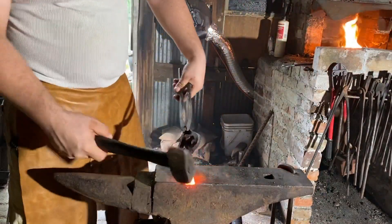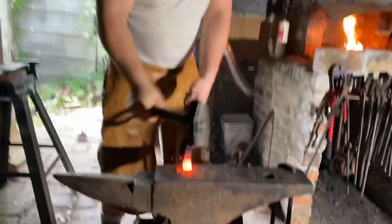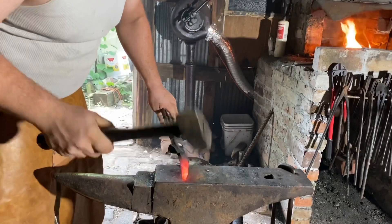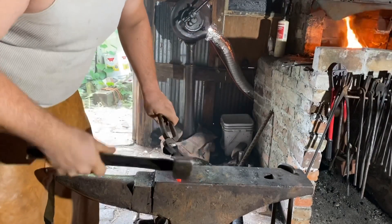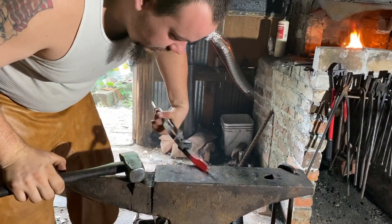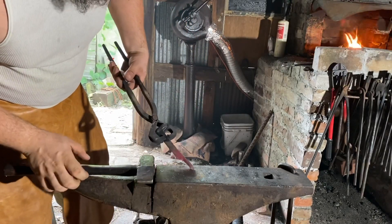Here I've clipped the point off a railroad spike. I'm just giving myself a shoulder so I know where to cut it later, but I'm gonna round this end up a little bit — about five sixteenths of an inch, and I want about a quarter. We're gonna set this up for the T-weld and work the tip of this out for the scarf of the T-weld.